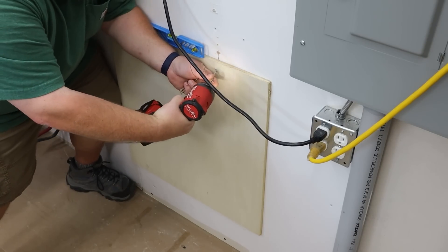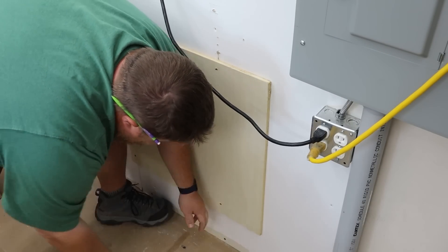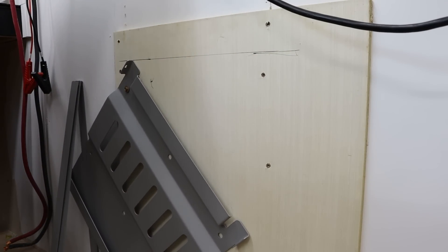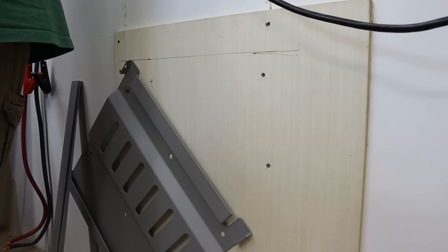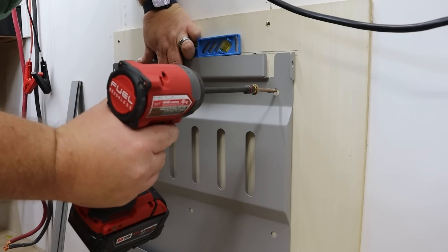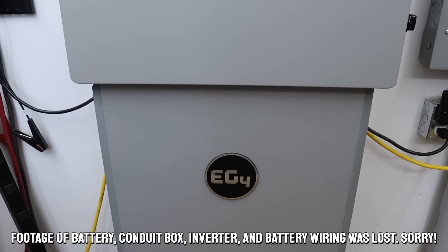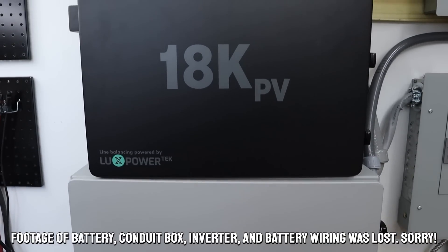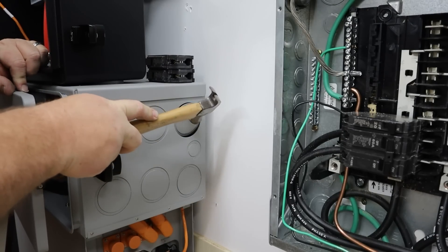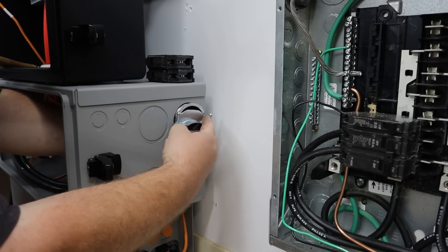If you have the combo unit like we have here, make sure you install the crossbars and the black bracket for the inverter to hang on the wall as well. I had to hook the battery onto the bracket by myself, so I utilized some simple machines — pieces of wood to create a lever — allowing me to lift the battery up by stepping on a board, wiggle it into place, say my prayers, and eventually I got it done. I would recommend you have some friends or family come help you, but if not, the simple lever fulcrum method does actually work. Once you have that battery mounted on the bracket, pat yourself on the back because you've just completed the hardest physical aspect of this installation.